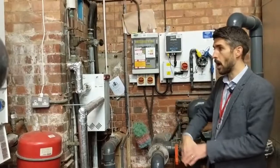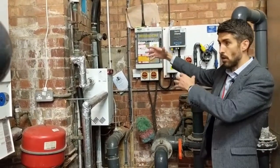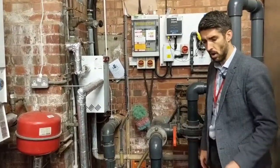This plant room is located below the level of the pool, so there's a head of pressure — gravity is basically ensuring that all of this pipework remains flooded, so the pumps are still primed.